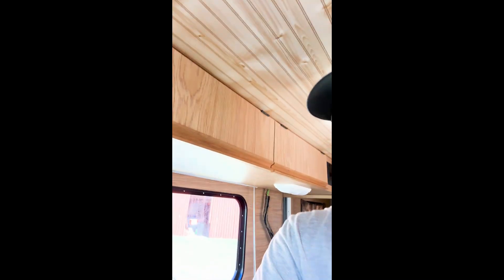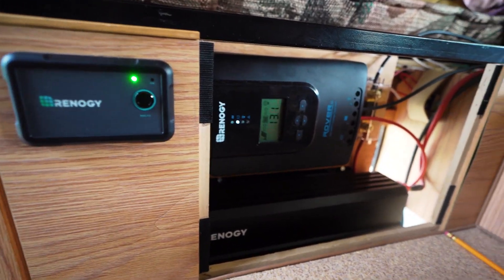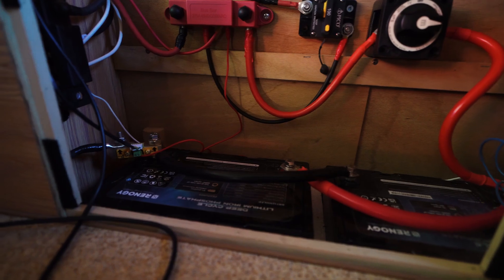I've got my inverter tied into the old electrical system, the circuit in here. So all the lights and all the plug-ins around the camper work once I flip the inverter on, and everything's running over to my batteries — all nice and tidy. If you get the pilot car kit, you can expect to pick up a couple of different things to make sure it fits your space, whether that be different size or different lengths of solar cable or battery cable.